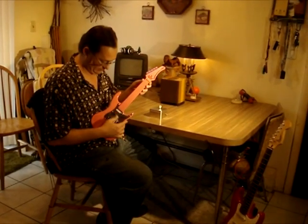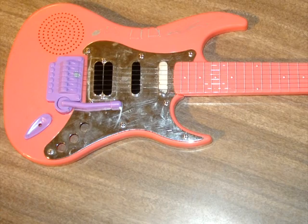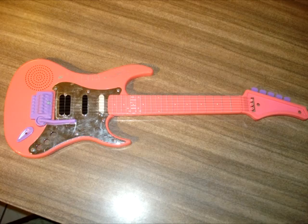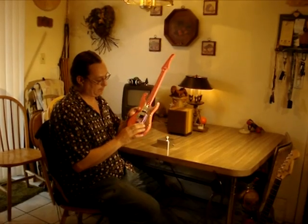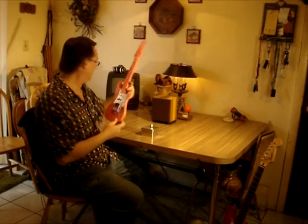I had a couple of 1/8-inch jacks and I was out of those and needed them for a project. Rather than go to Radio Shack and give them $2.50 for two of them, I figured there was probably something else in here I could use. There were a couple of buttons and a mic jack, and I had my fingers crossed there would be a PT-2399 — an echo chip. Some of these kiddie guitar or sing-along things that have a mic jack will have an echo in there, and you can remove the timing resistor to get a nice long delay, put in a pot for the feedback — it's a pretty cool cheap little hack for an analog delay.